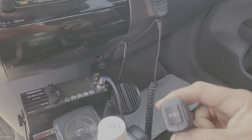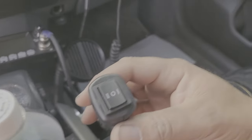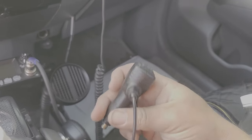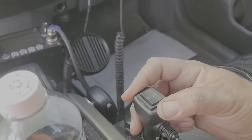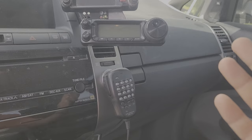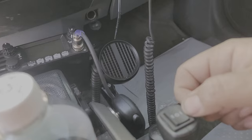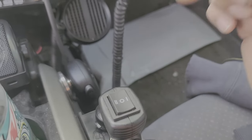The antenna is electric and it comes with a cable — I'll leave all the description and specs below — but it uses a cigarette lighter plug. The cable runs back to the antenna, and you just plug it in. With the FT891, I just switch to AM or CW on low power, key up, and the single mark raises the antenna up; hit the double and it lowers the antenna.